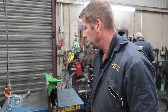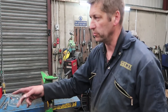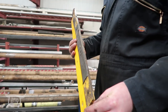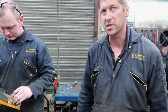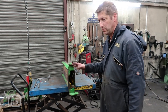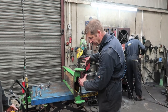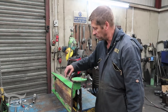So why are we replacing them? Well, there's a wee bit of wear in both bits, so you're accommodating a bit of wear. Here are the old ones — they're not too bad, probably for the hours it's done. You're talking about two to three millimetres of wear on each slide at the moment, so if you have that on top and bottom, you've gained four or five millimetres of tightness again. The wear is more at the front and back because the hitch is trying to cantilever over the front edge, so the front and back edges will wear more than the middle.